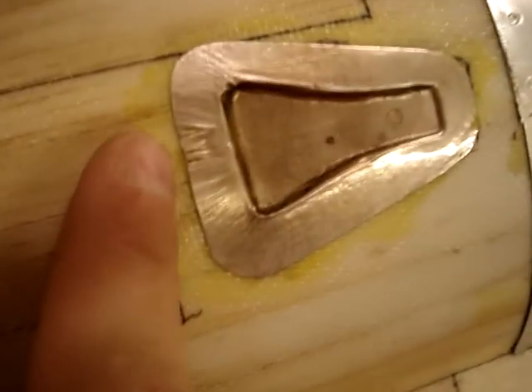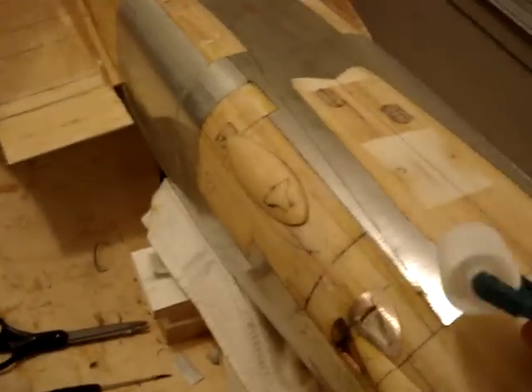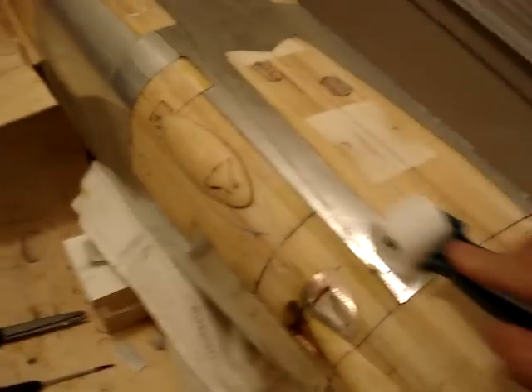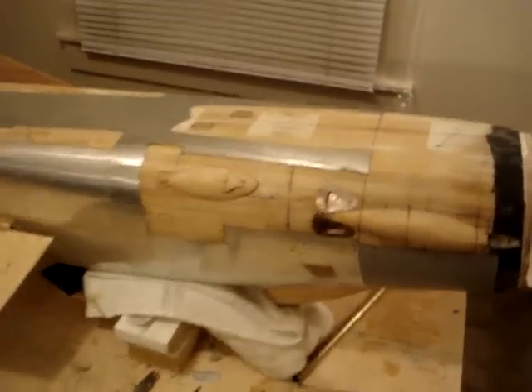What happens is you can actually see these little wrinkles here — the aluminum kind of wrinkles onto itself so it can form down into the really tight crevices and get a nice crisp line. What I used to get rid of those wrinkles is that right there — it's just a wallpaper seam roller, about two bucks. It works a treat whenever you get ready to apply your aluminum panel: put your contact adhesive on both sides, get on there, and then just roll it up and down. It works really well for getting it to go around the curves.